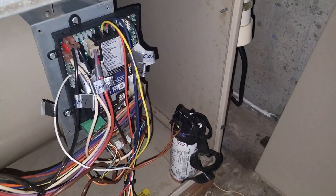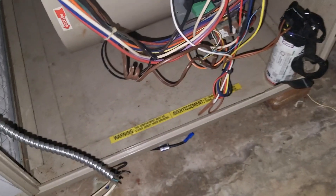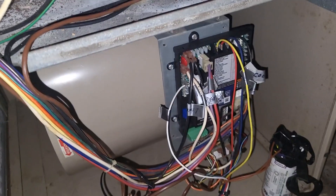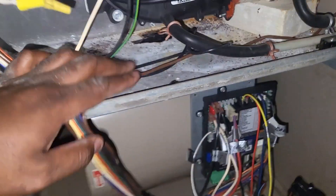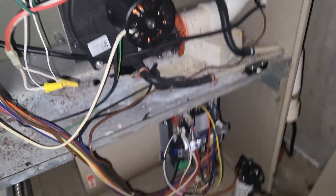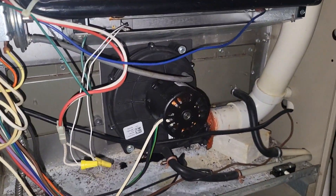At this point, just due to the age of this furnace and the fact that someone put a board in — putting two and two together — I don't know if this thing even worked after what the guy tried last year. The fact that the EAC was hooked up even though it wasn't needed, I think this board probably fried the circuit in this furnace. If this were a newer furnace I'd say go ahead and try a new board, but at this point I'm going to recommend upgrading to a new 90 percenter and being done with it.